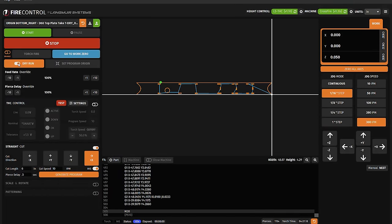The clearances are very tight down here. This truss is pretty close to the oil pan, but compared to my red Jeep out there with the Dana 30, we're really not all that close, so I'm not too worried about that — that's what the bump stops are going to be for. If anything, we might need to go up with the body a little up front. In the rear, we're going to have to go at least one or two inches. Now this truss is all tacked together to itself — it's not tacked to the axle yet, so later once the axle comes out we can take the truss off and weld the tubes up. I put it back under the Jeep and got it all squared so we can build some control arm mounts.